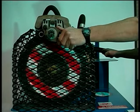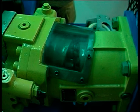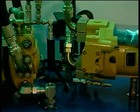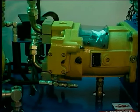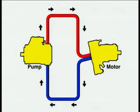As we apply the brake, we can see the internal components of the motor respond. This system — composed of hydraulic pump, motor, controls, and filtration element — is referred to as a hydrostatic transmission. All of the components are connected in a closed-loop hydraulic circuit, meaning the oil in the system is constantly cycled from the pump to the motor and back again.